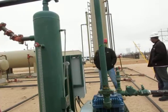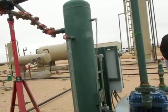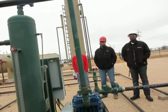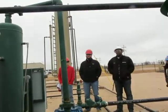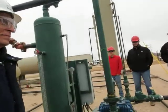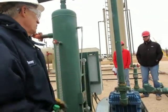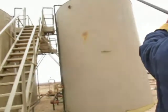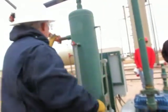Okay, so what was the working pressure of the atmospheric vapor recovery tower? What's the working pressure of a tank? Huh? These tanks? Yeah. Should be very low. Yeah, it's going to be very low, like 1 psi they may be rated at. We don't want any more than like a few ounces of pressure on them. So our gas that comes off the top of the tank ties in with the gas that came off our vapor recovery tower. We bring it through this scrubber,